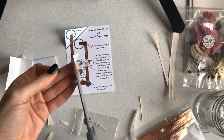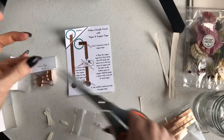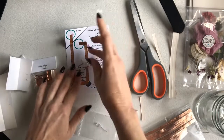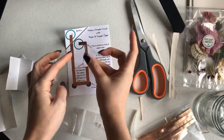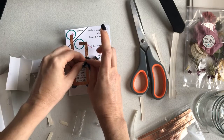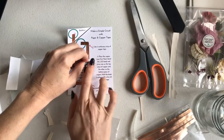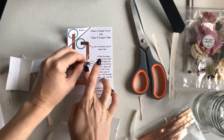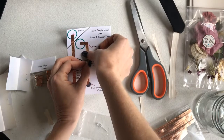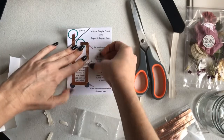You can use scotch tape, packaging tape, or electrical tape — that flexibility is why it wasn't included in the kit. I have two tiny little pieces. The legs on the LED are called leads, and I bent them away from each other and then bent them sort of straight so they'll make strong contact with the copper tape. I'm doing one piece at a time, using my nail to make sure the tape holds firmly in place.